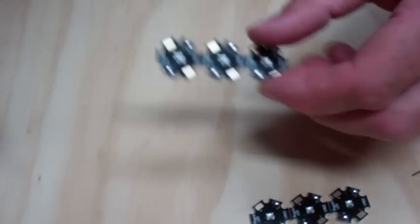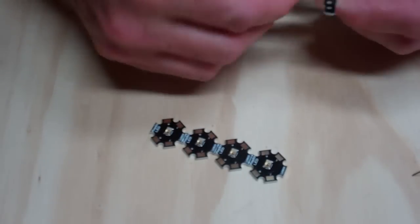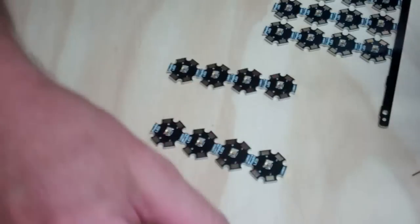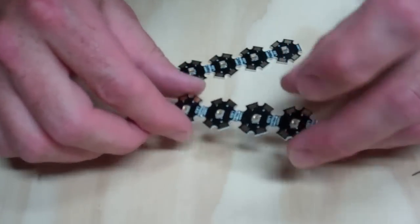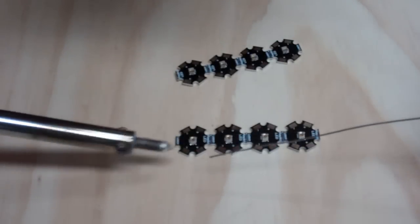You want the solder to bead up. If you get a little point sticking up, that means your soldering iron is not hot enough. You want that solder to bead over on top where it's a nice smooth look — almost like a bead of mercury. Let me make sure I got these right here. I'm going to do the minus side on this one. These new Philips star 660s are on really good stars.